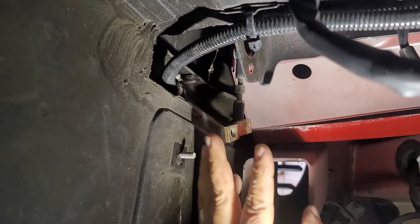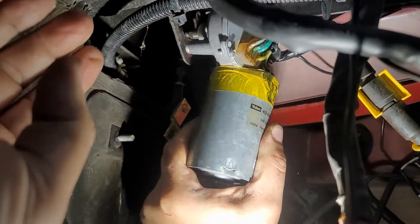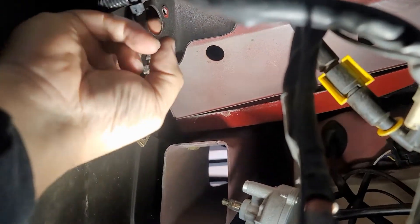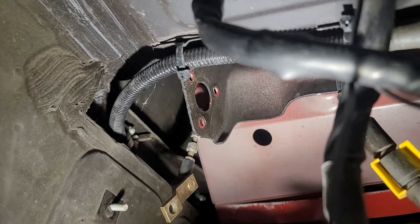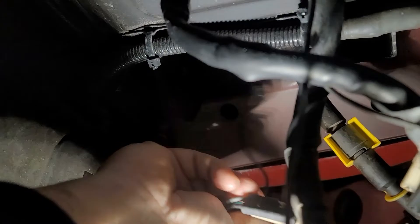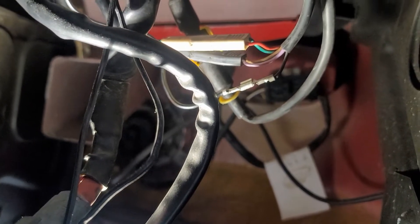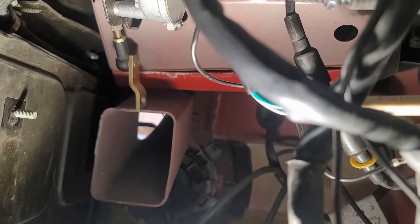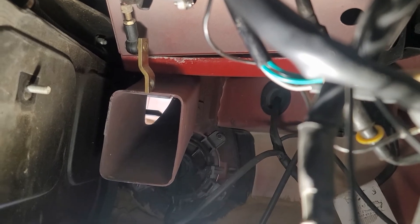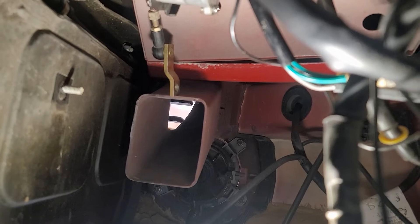We're reinstalling this motor. This linkage here is going to go through this hole, then the linkage goes on this shaft. There are three holes with 10 millimeter bolt heads that will attach this motor to this bracket, and this linkage then attaches to the lifting motor itself. We also have these electrical connections that we talked about earlier. We've got everything hooked up except for the arm because we're not sure of the position of the gear. We've got all our wire harnesses hooked up temporarily, then we're going to run the motor through so we know where the gear is at — we don't want to hook up in the wrong position and break something.